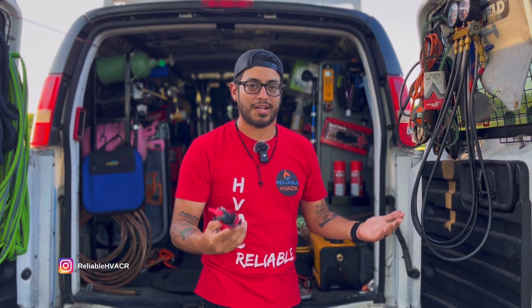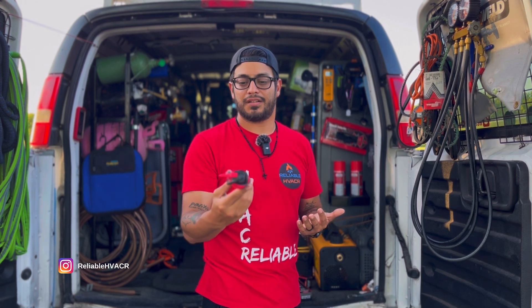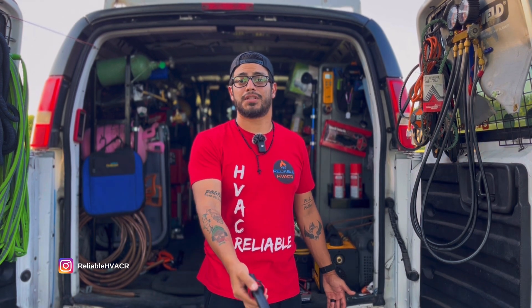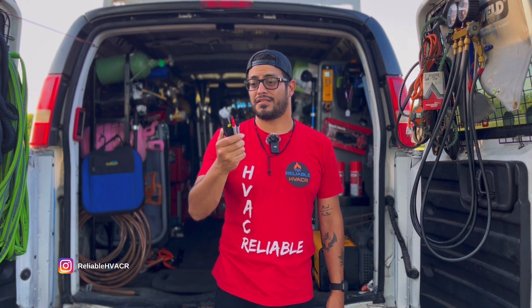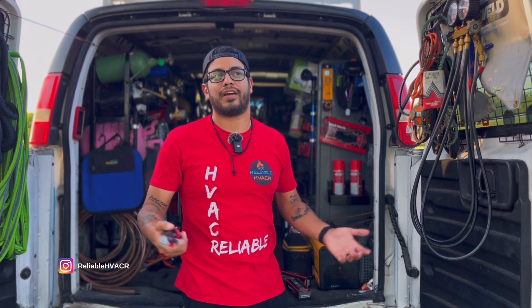And I got a meter with me that I can check voltage. I can do non-contact voltage, I can check capacitors, I can even check Hertz — just a few things that a basic meter needs to do. So like with the other cell phone type one, this is not an all-in-one meter because we do need amperage and a few other things. But this is an awesome grab and go — it's just a voltmeter. Think about it like that. It's a voltmeter. You need to go check voltage, you want to know if something's live or not, and you want to do a continuity check, wire repair, anything small. This does basically everything I would need it to except when I'm checking compressors or motors. But for that, I have my big bag.